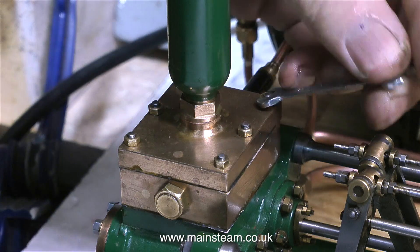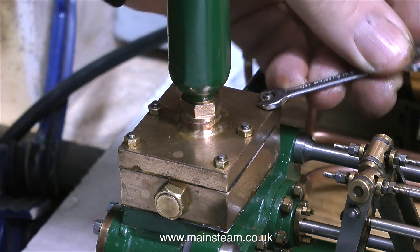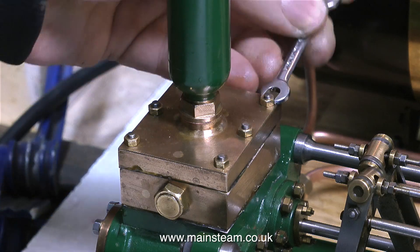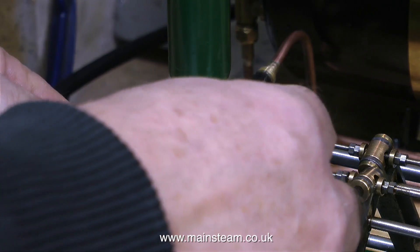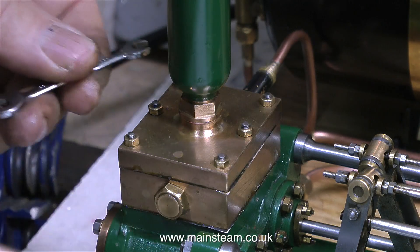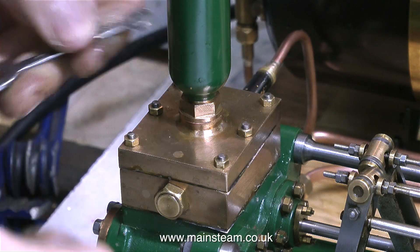So what is the problem, I wonder? Inside this water chest there are eight water valves — four for the inlet and four for the outlet. These valves are the same shape as valves used in cars; they sit over the hole and are ground into the hole so that the seat of the valve matches the seat in the hole. So what can possibly go wrong? Why aren't the valves working?